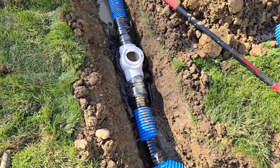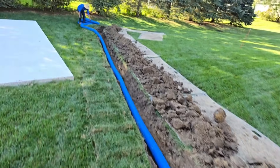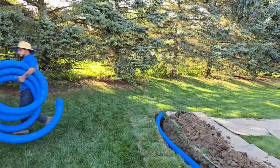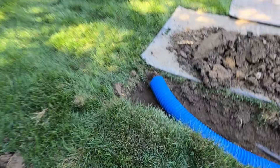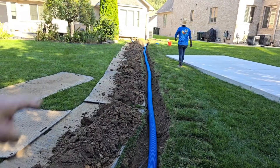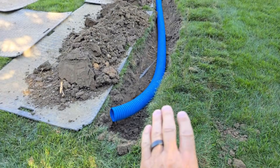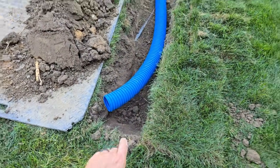A few really good things about that Y. Then we go into our sediment trap right here. To get this to where it's gonna drain, the guys had to run it way back here — 45 feet. The lower you can get your discharge end, the less water you're gonna leave upstream in the line. So if you don't want this to freeze in the winter, you have to take the discharge to where it's low.